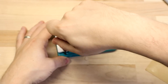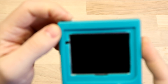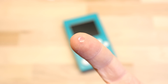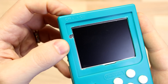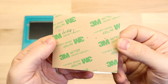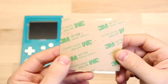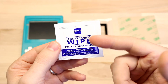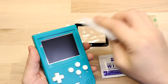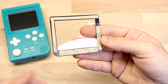If you got everything on the shell cut out properly, everything should fit in there pretty nicely. I'm going to add a laser-cut acrylic piece that I've sanded on both sides to diffuse the LED and make it look a little nicer. For the screen assembly, you'll need some double-sided tape — Kite recommends 467 MP, though just about any double-sided tape should work. You'll also need cleaning wipes to clean off the screen and lens before putting it together, and definitely some canned air to blow all the dust out. If you want to make sure no dust can get in down the road, make sure there are no gaps; I'm not too concerned about it so I'm just leaving mine as is.